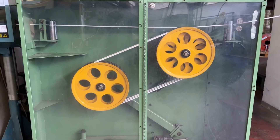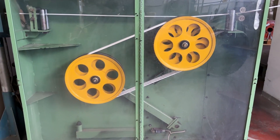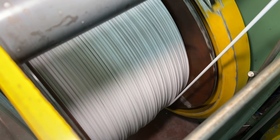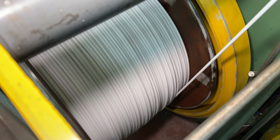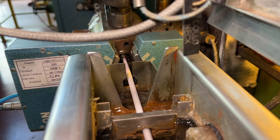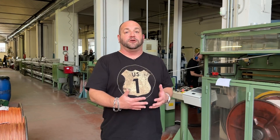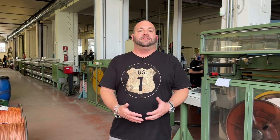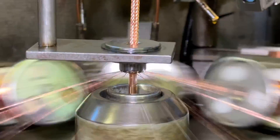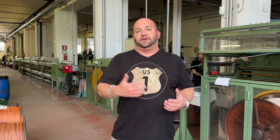Then here is a system of compensation, and here we are gathering all the dielectric which will be automatically moved from one bobbin to the next as soon as the current bobbin is full. Now that we know how the high-pressure triple-layer foam dielectric is applied to the core of the coaxial cable, stay tuned for the next video in this series, where we're going to take a look at how they apply the shield, the foil, and the braid to the coaxial cable.